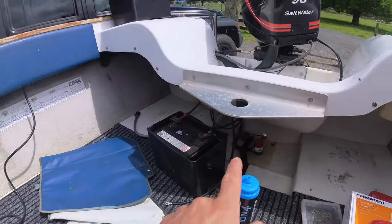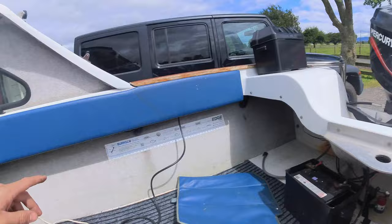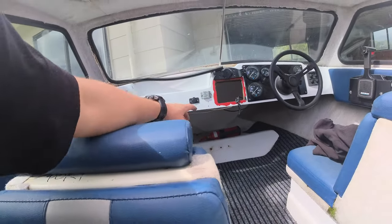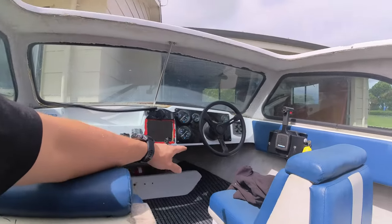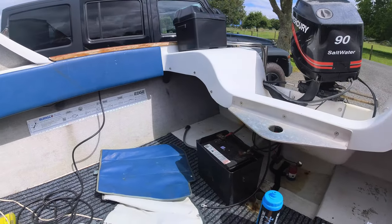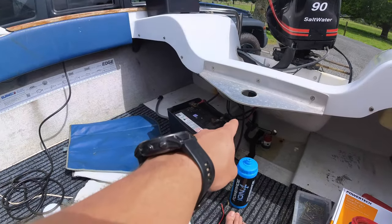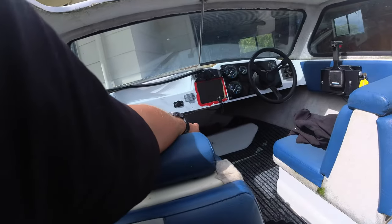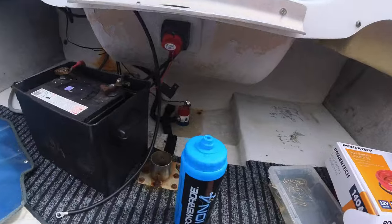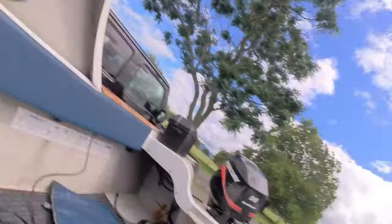Our old battery sits just in that gap there, right at the back. We're going to put the new battery at the front, under there, out of the way. Obviously you can put it wherever you want in your boat. For me, I need five meters of cable to run all the way around to connect to this battery. I'm going to show you how to do it. First, I'm running the positive and the negative from that battery — you need a negative from that battery to your other battery and into your appliances, and you need a positive which is going to sit where the isolator is and run all the way around to the back of the boat.